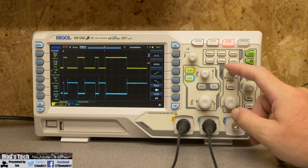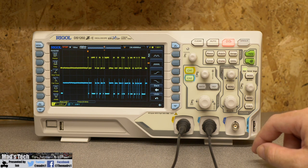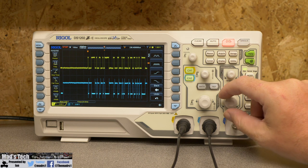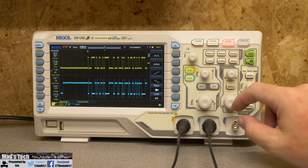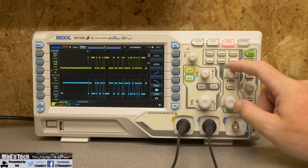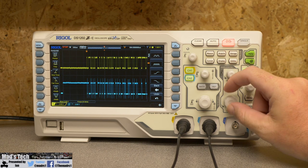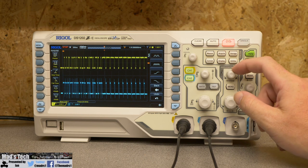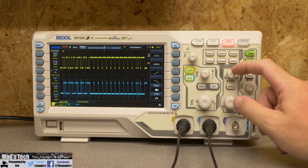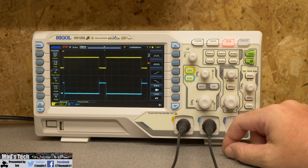Because we're looking at the two different outputs on the same receiver, the data is mirroring, making the difference easy to see. When connecting to your flight controller, you need to make sure it either allows you to invert the input or does it automatically, so it can correctly read the logic data without worrying about the signal polarity. Most new flight controllers do have inversion on board. You can really see it is a mirror — rather than starting at ground and pulling high, standard SBUS starts at high and pulls to ground.